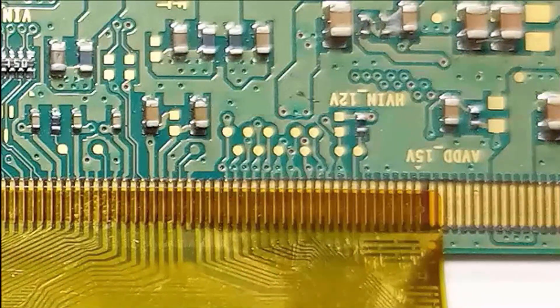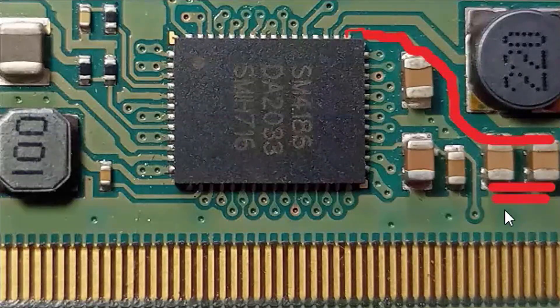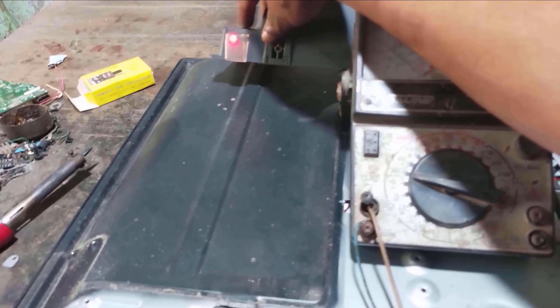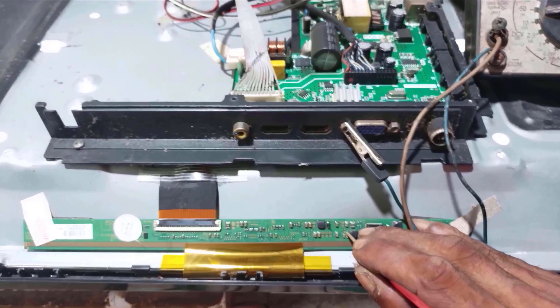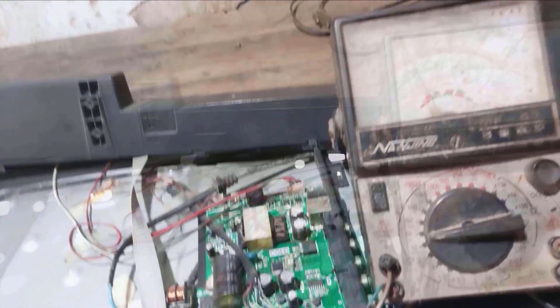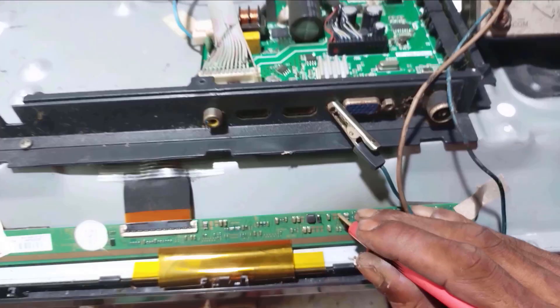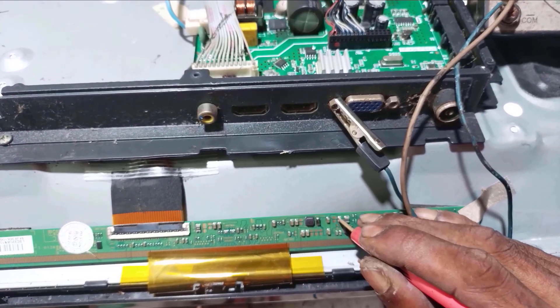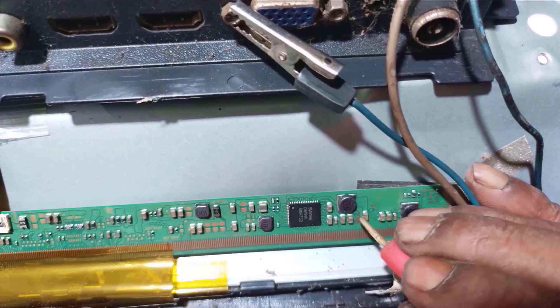These CKV commons are output from this side of the DC-to-DC IC. Let's check some voltages on this DC-to-DC IC. First, let's release the TV to standby. Look — 3.3 volts are present here. Then look at 1.8 volts — 1.8 volts are present.